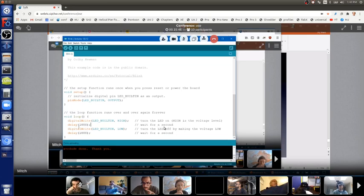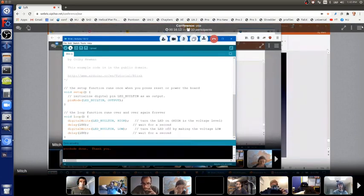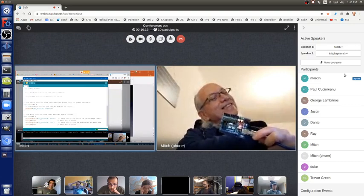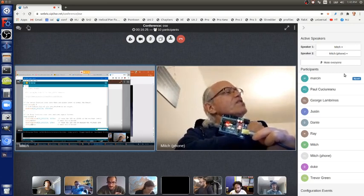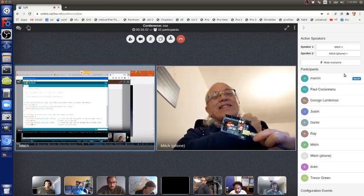Okay, so I'm going to change it from 1,000 to 100. And same down here. But notice that's just text on a screen. The LED is still blinking the same. In order to change that, to update that, I've got to go back to the upload button here and then click on it. So I just clicked on it. And so it will compile, and it's interacting with this video conferencing software in weird ways. My computer's going very slowly. It should do that in a quarter second, but let's give it time to do its thing.